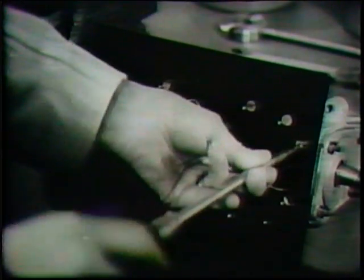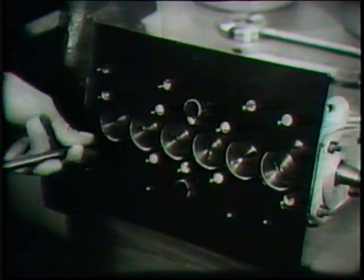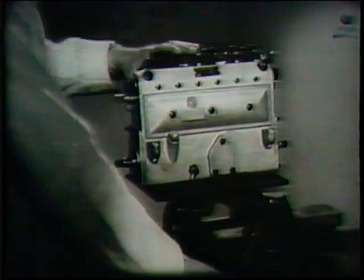When carrying out a test in the workshop, the pump is fixed to a special base plate which carries two lugs for mounting in a vice. Damage may occur to the pump body if the pump is mounted directly into a vice. The pump is mounted so that the coupling end is towards the operator.